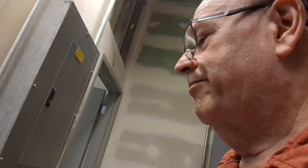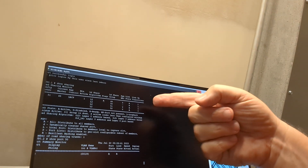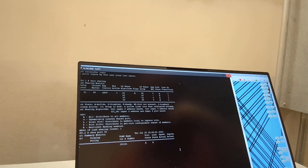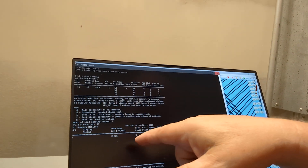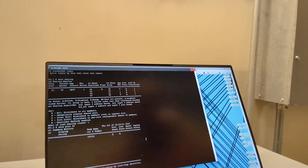So I'm like, what the heck? But the port we're showing is down. So I got on the switch. Let me show you what I was seeing. I get on my switch, and right here I said, okay, show me the status of the shared port — show sharing. And I could see that yeah, they were all up and active, except for port 50, which is the one we were just looking at in there. It shows that it's ready, not active. A is active, R is ready. So I said, all right, show me port 50. What's going on with port 50? It says it's enabled, but it's ready. It's not active.